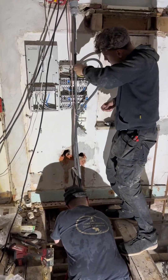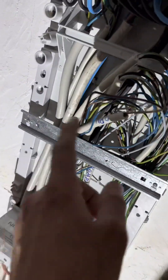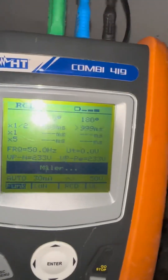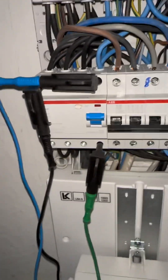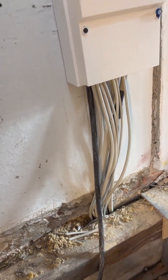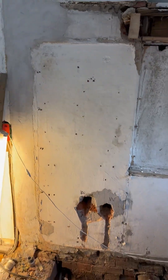I did heavily damage the wire — luckily, I didn't actually do any real damage, it just looked very scary, and it was able to be fixed. Either way, the plumber's here, the electrician is here, it's all chaos. The reason I don't want to put all of these wires into the circuit breakers is because they're not mounted in the other end, and people will just turn on the circuit breakers, so that's why I've just hidden them. Then it was time to put power back on the house. Before we turn on the power, we've got to make sure all of our safety equipment is working — the RCD and all of the good stuff. It's also time to check the ground connection; we're looking for a number below 1600 ohm, and we've got 28 ohm. And with that, the fuse panel is not at all done — I still need to put up a massive thing down here to hide all of the wires, but we can't do that until we have the floor. At least the fuse panel is gone from over here.